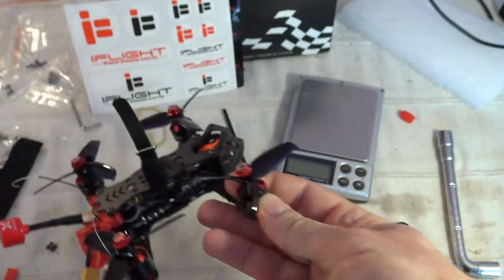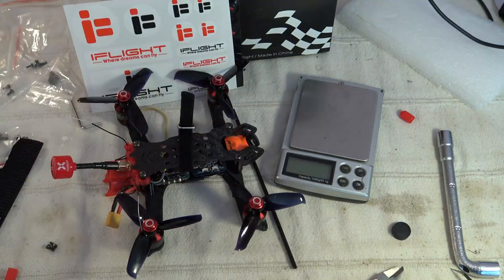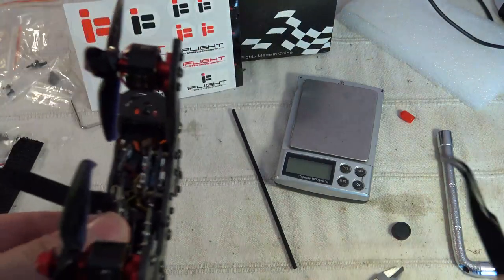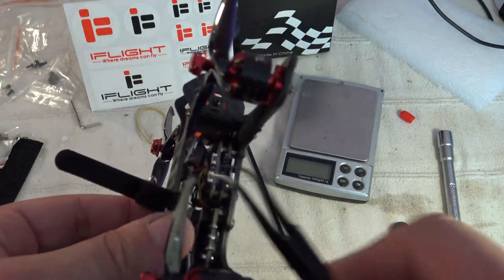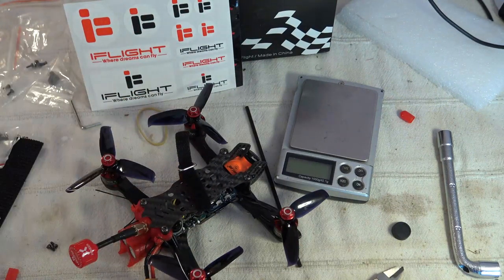Whatever, it's heavy, okay, so we will see in terms of stability. As you may know, the first iFlight EH3 was suffering from a lot of oscillation and required a lot of PID tuning. You have to know that the board here is installed on nylon and some foam o-rings, so it should dampen a little bit the vibration transmitted.